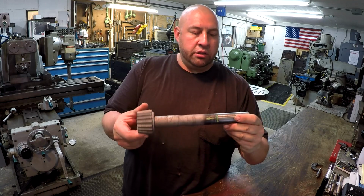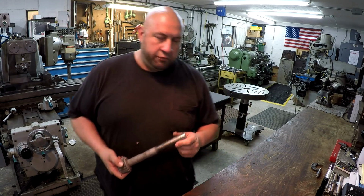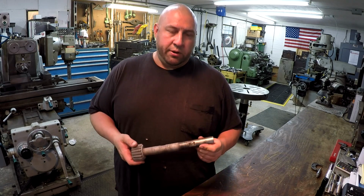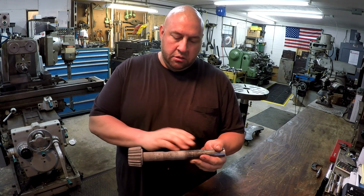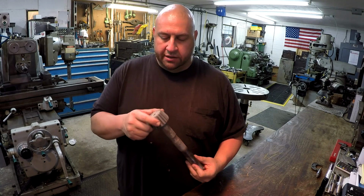So what we are going to do, he sent it to me because I do spray welding. Some of you may have seen some of my spray welding. If you haven't, you're about to see some spray welding, because that's why we're going to fix this. I'm going to set it up in the lathe, and we're going to do some masking, and we'll do our undercutting, we'll do our spray welding, and turn it back to size.